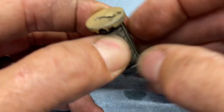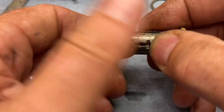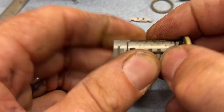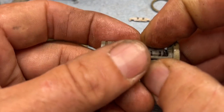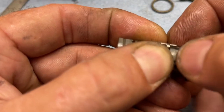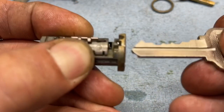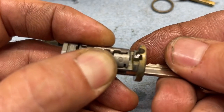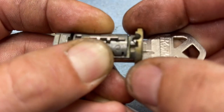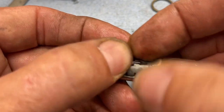That went together really well. I'm holding pressure towards the back of the plug, just like that, making sure it slides — it's in the zero state right now. Just like you were pushing it, but we do still have to hold it. And we need our sidebar back in. Keep holding this pressure back as far as we can, and insert the key, being careful not to make the sidebar jump off. Make sure it's all the way in, then let it go.